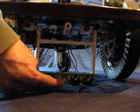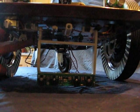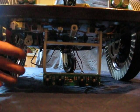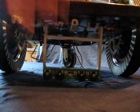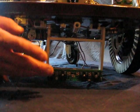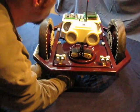And there's actually a reed switch on the back of this which contacts a magnet up there, so when it's in its up position, the reed switch clicks and actually turns off all the emitters, so that doesn't stay on all the time. And also when it's in its down position, I can again turn off the servos, so if it were to hit something, which it shouldn't, it can be pushed out of the way without the servos trying to fight it. So there's Walter the robot.